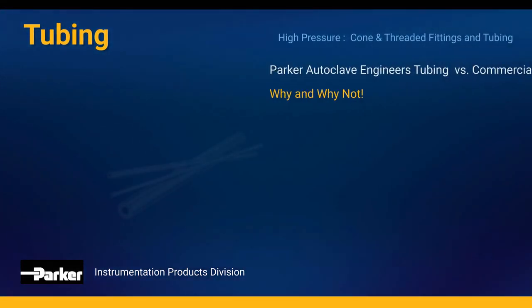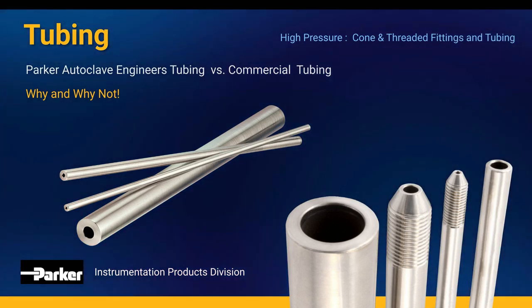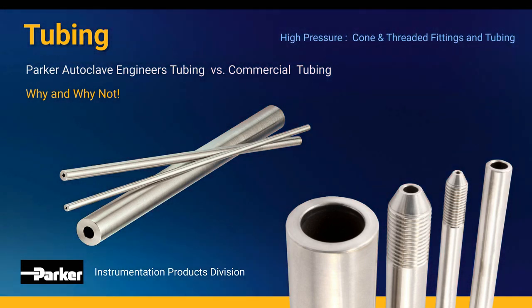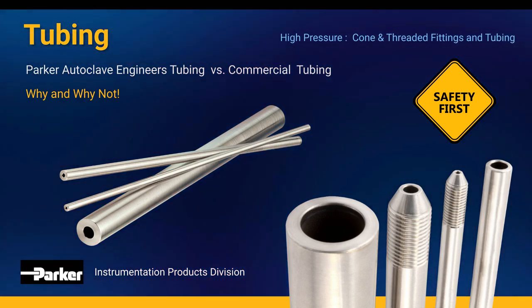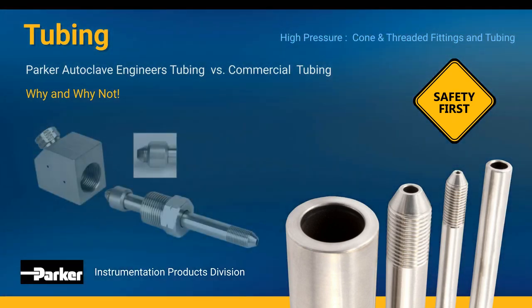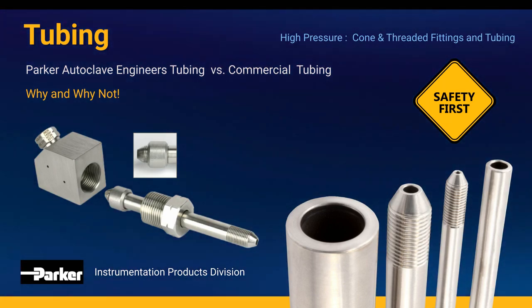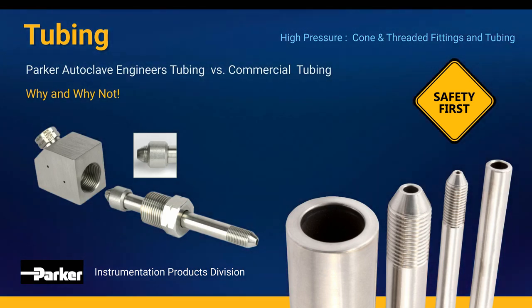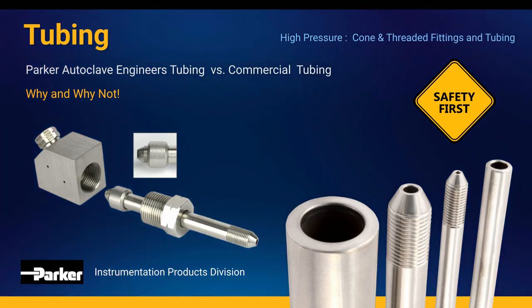In the 1950s, Parker Autoclave engineers started manufacturing high-pressure fittings and tubing for use in laboratories and industry. Our engineers have always been focused on creating products that exceed industry standards and safety requirements, with a remarkable track record of product development, innovation, and product safety. Each of our pressure ranges have unique requirements and connections that do not interchange for safety reasons. Features include a heavy wall and high tensile strength needed to contain the high pressures, but also to allow the formation of the cone end with sufficient wall thickness that will not crush as it is forced into the mating female cone. Additionally, cone and thread tubing has a smaller outside diameter than commercial tubing in order to correctly fit standard threading dies, keeping tooling costs to a minimum. The correctly made threads mechanically hold a collar used as a bearing surface for a rotating gland that moves the tubing into the female connection with only minimal torque, preventing tube ejection.